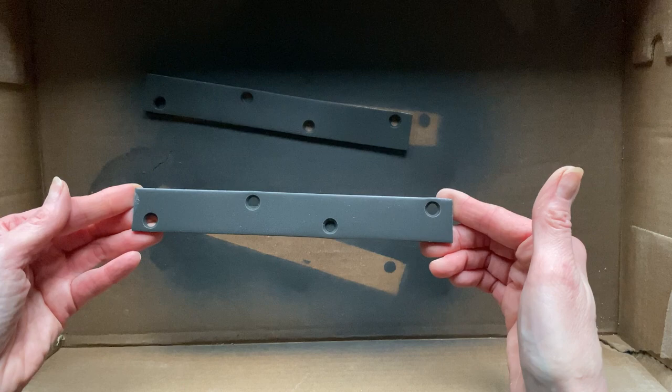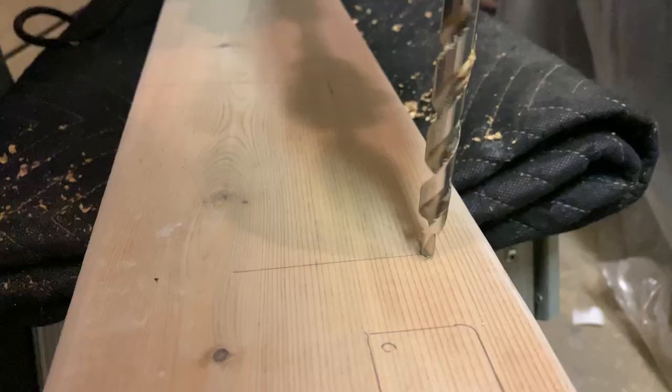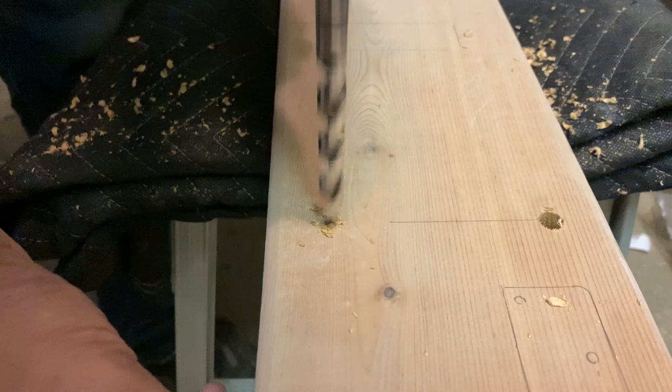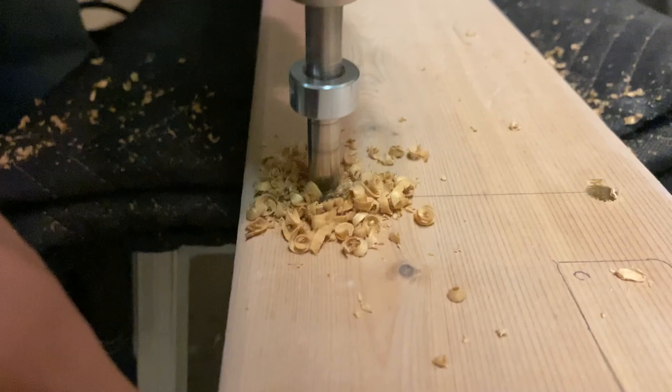Using the charcoal black by Rust-Oleum, I've gone ahead and sprayed those brackets. And now we're going to make some accent holes, and we're only using about 1/2 inch screw, and we're going to be making 2 on each end. And we've drawn out exactly where the legs and these accent holes are going.